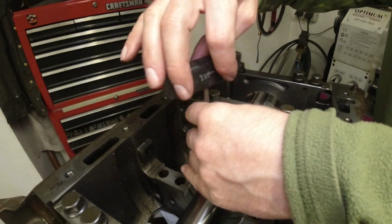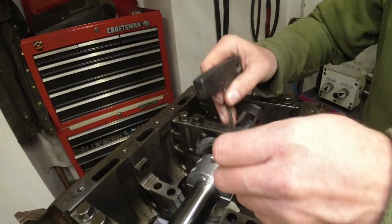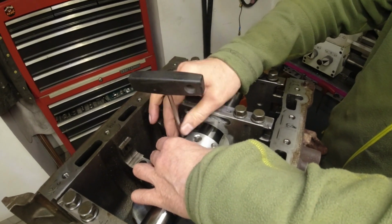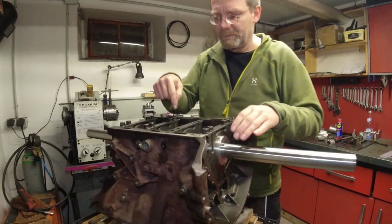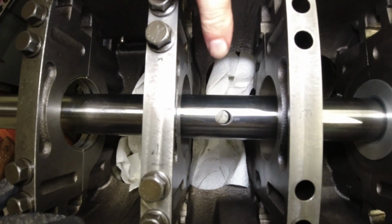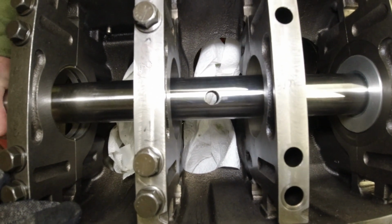In order to make this bar an actual boring bar, I needed to install a cutting tool. I have only 10% battery left. As usual. So I take this out. Okay. Look from the top here inside. Here you can see that I drilled a 12 millimeter hole through the hardened boring bar. Now that's not an easy operation, but it's in there.